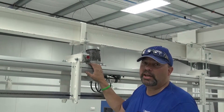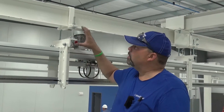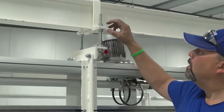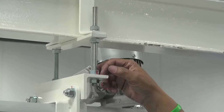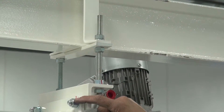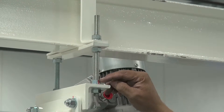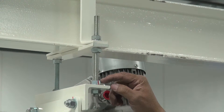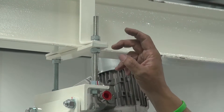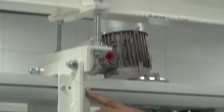Also on your PM, at least once a year, go through your system and look at all your bolt connections and make sure your bolt connections are tight. You'll notice that we use a split lock washer on all of our nuts. We use nylock nuts. Up here on the half-inch hardware, we always have a split lock washer. We've match-marked our nuts to the washers, so you'll want to make sure that this connection is tight.